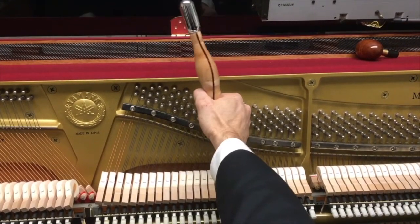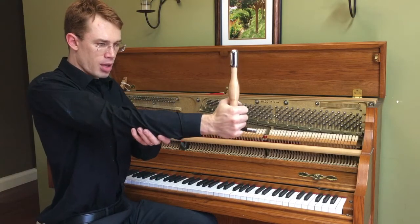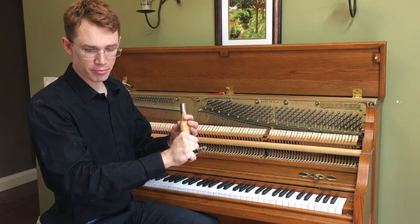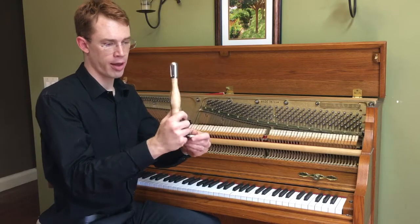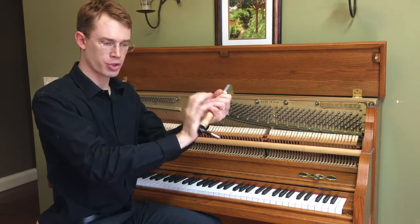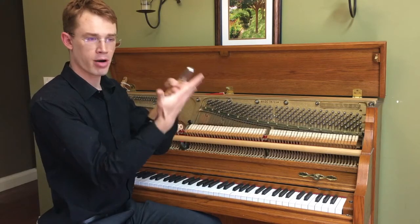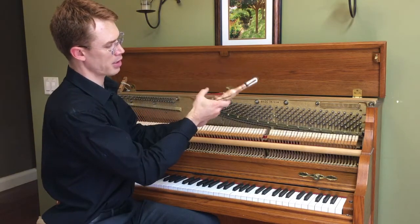This is the most commonly taught method, and that is to approach the impact hammer directly. It's a pure forearm rotation. Now, anytime that I'm working with an impact hammer, I'm not holding it. I'm not gripping it. I'm just encouraging it to move one direction or another and not to come off the pin. So I've got the contact point here where I'm pushing it onto the pin, and I've got a contact point here and here. I'm using the upper part of my hand and the inside of my thumb, and I'm tossing it.